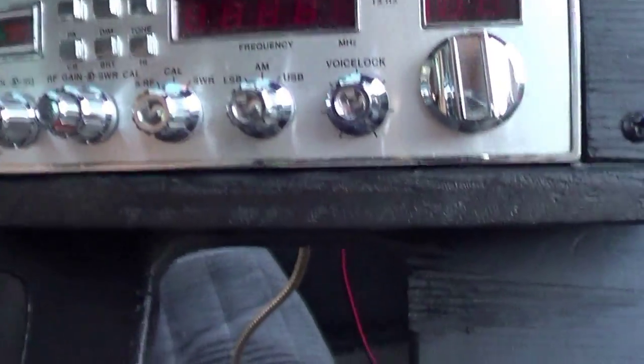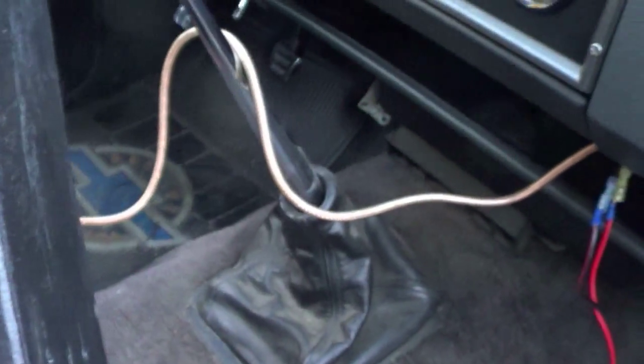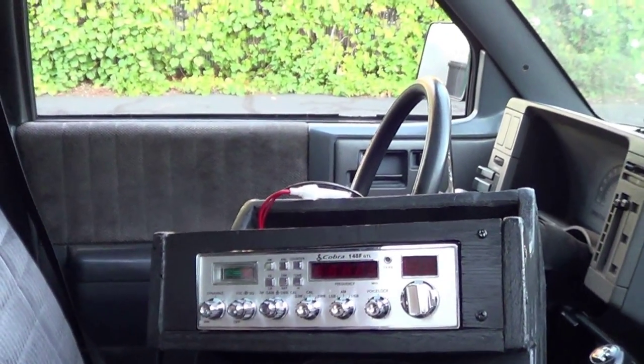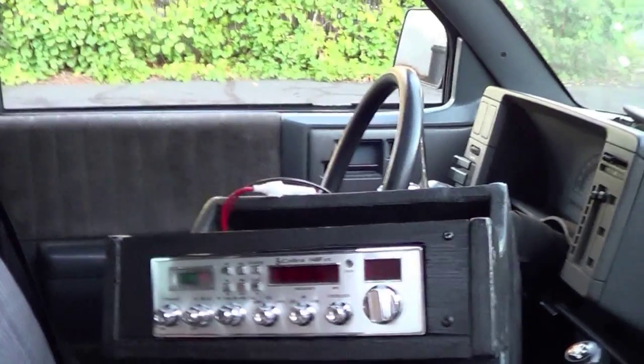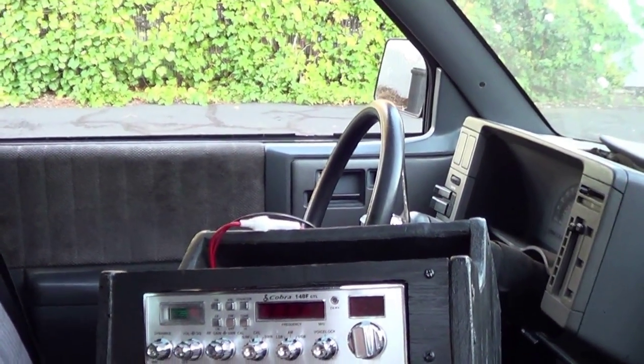So I'm going to go ahead and disconnect my coax, take my ohm meter, make sure I don't have a short somewhere running back here to the gunny puck. And then if it checks out good, and I'm almost sure it will, it did before, then I'll grab that other 18 feet of coax, connect that up, and we'll put that in and see if that doesn't do it.